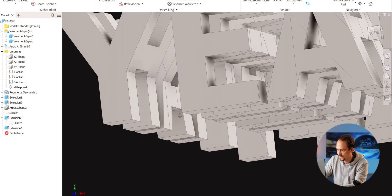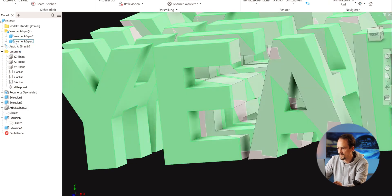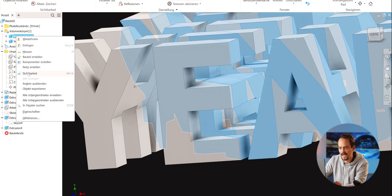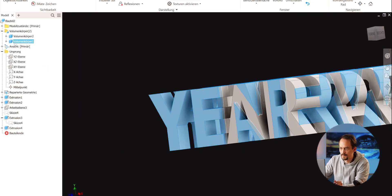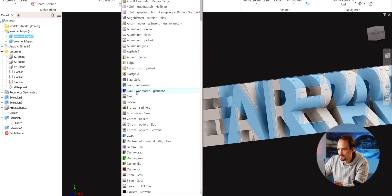Let me zoom in so you can see it better. If I hover this one you see what's green, and if I hide it you can see through the part. To make it even more visible I color the other volume blue. In my original I kept the whole array because I thought it just looks neat to present — it's very complicated. But that was only possible because I printed it in Polyjet, where I didn't need to remove supports manually, since supports in Polyjet are a wax-like structure that just needs high-pressure water. So there you have it — that's how I did a three-way optical illusion.